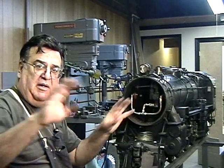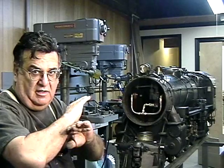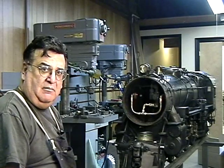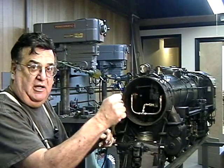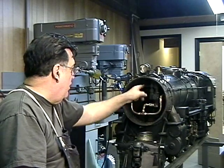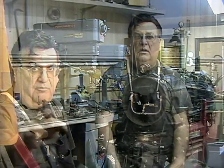This is what's called a quick-opening gate valve — I've mentioned it many times in my videos. If you want to continue using a ball valve, go right ahead, but they're awful. You've got 90 degrees open-to-close on a ball valve. Watch what I've got: that's closed, that's open — full open to full closed. Much more control. I don't need a lot of stroke; I've got double leverage. You can pull it about halfway and you're only getting about that much movement. You've got a lot of control — only about 15-20 degrees open to close, versus 90 degrees on a ball valve.